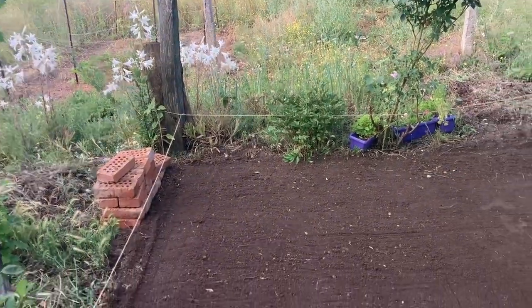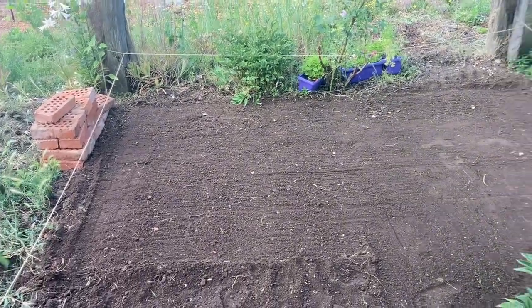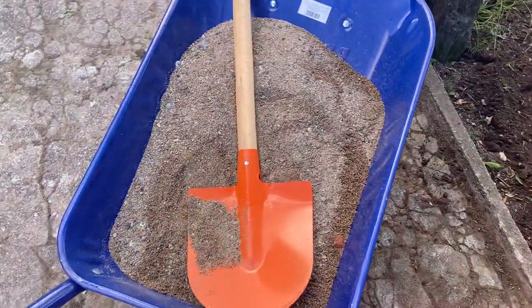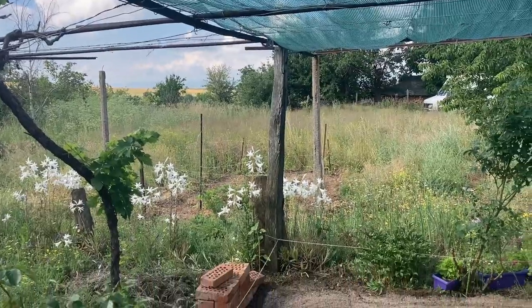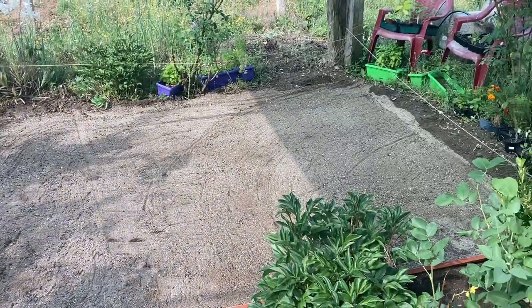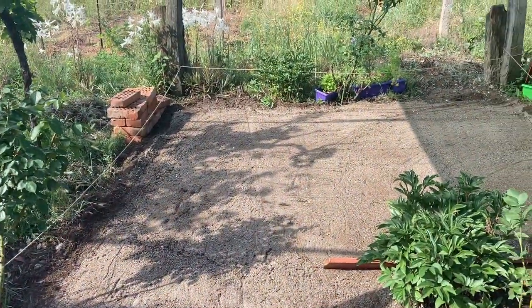Here's the update: I've moved the bricks out of the way and I've leveled off this area and a little bit over there. I used this plank here to make it as level as possible and it's looking really good. I'm gonna start off with this area here and put the bricks there, but first I'm gonna put the sand over there, which will help level it even more. Sand is in - I've leveled it out nicely. It's really thin because it's not for drainage, it's just to help level it out. Sand is finished for now - I'm gonna start with the bricks.